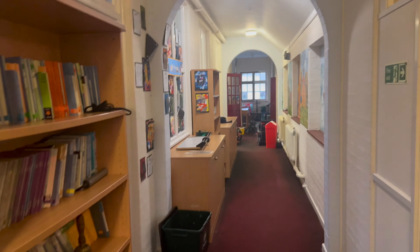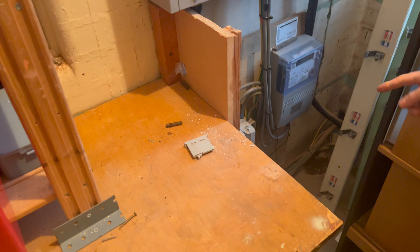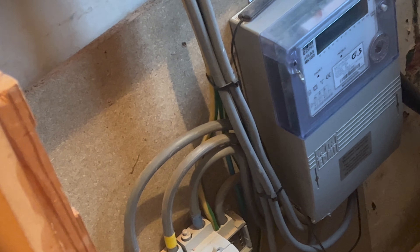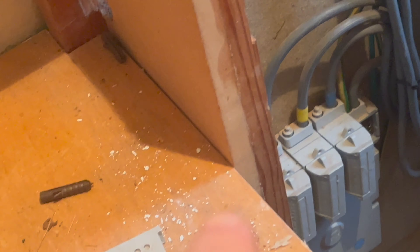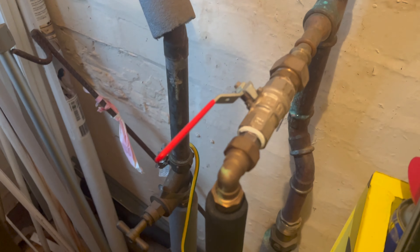This used to be the main part but it's completely doubled in size. What we've found already is that cover has come off — that is actually probably a C1, because that's the neutral and live conductors exposed. We're obviously going to repair that before we go today, and we'll report it. We've also found that the earth has been disconnected.